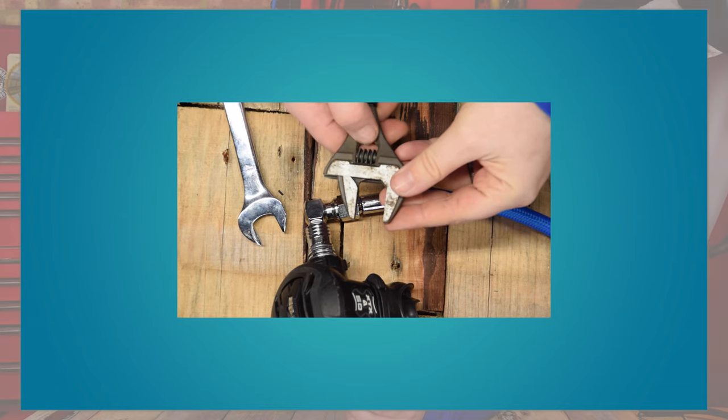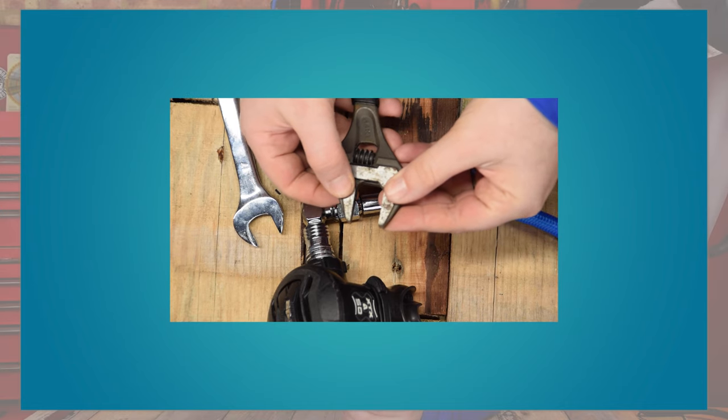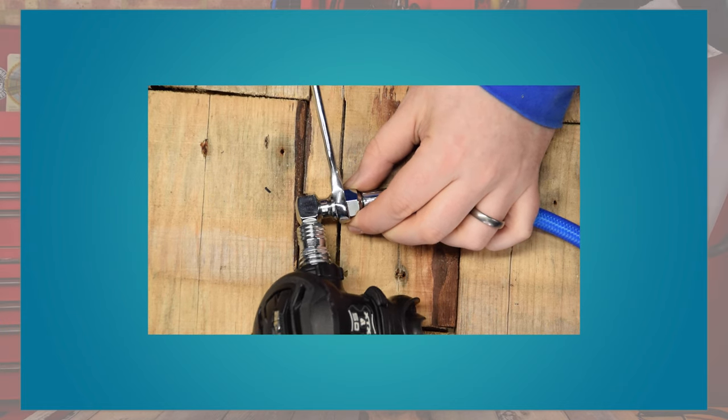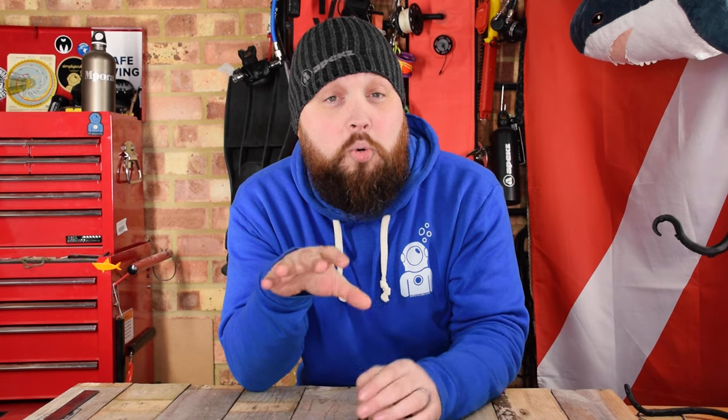If you're changing the hoses on your regulators, try to use fixed spanners or wrenches instead of adjustable spanners. An adjustable spanner's jaw can shift as you're using it, so as you go to tighten or loosen a nut it can slip and damage it. Also, hose manufacturers can use either metric or imperial fittings, so whilst a fixed spanner might seem to fit, it might just be a similar metric-to-imperial size. Make sure you have a bit of both so you're using the correct one and not damaging your regulators.